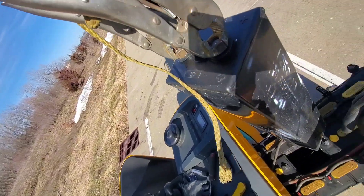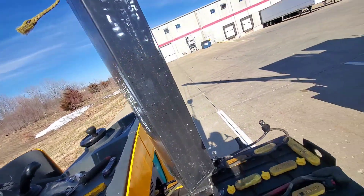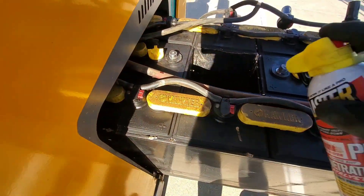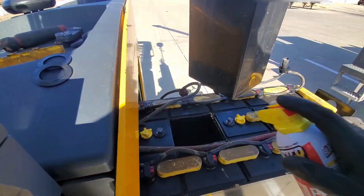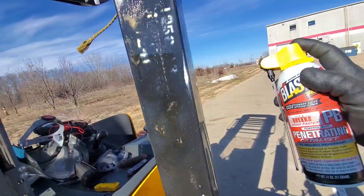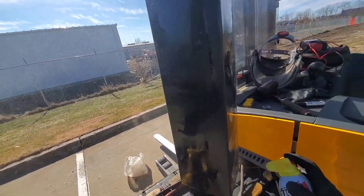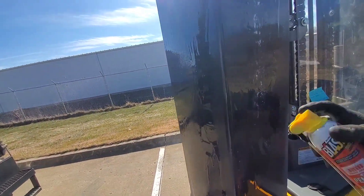As you saw when it came out, it kind of stretched the lugs out a little bit. That's because it's fairly dry down in there, so we're going to give it something to slide on. This is PB Blaster — it's somewhat of a corrosion inhibitor. Give it a little spritz on the sliding surfaces so hopefully it slides all the way down.